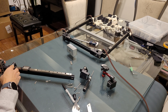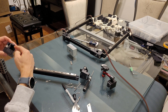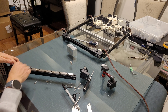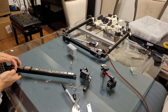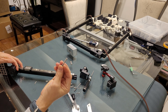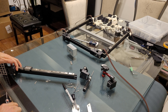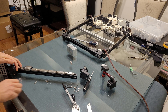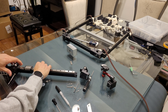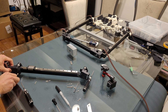When I put the side joints together, I make sure I have it square before I tighten — I tighten the bottom screw first and push the linear rail flush to the surface of the 3D printed part. I hold it tight to make sure this is perpendicular, then tighten the screw — I think it's M5x40, but check the instruction manual for the correct spec.